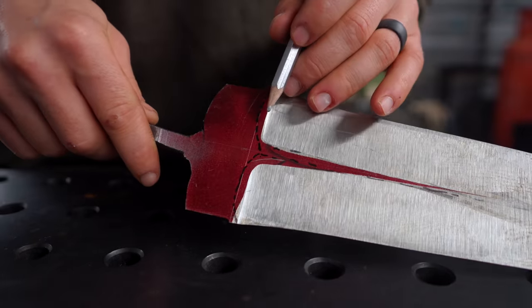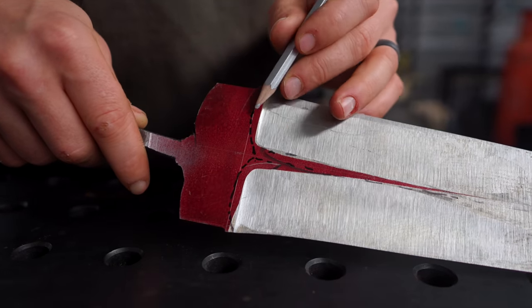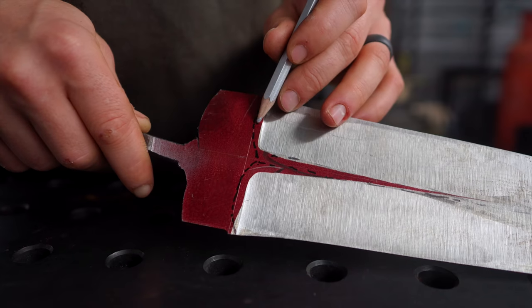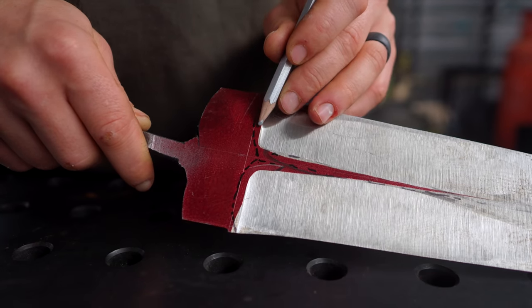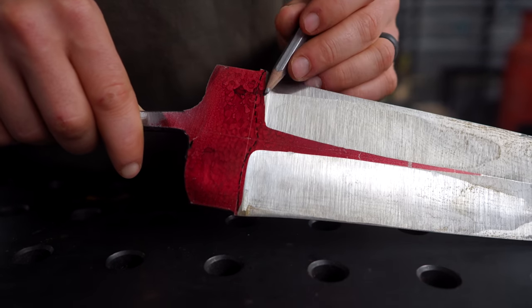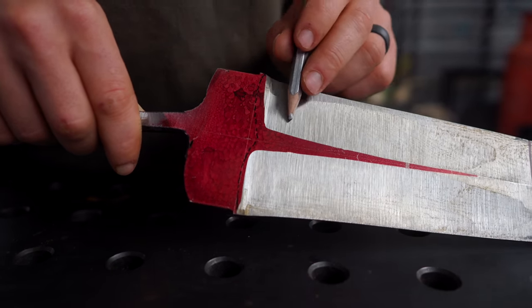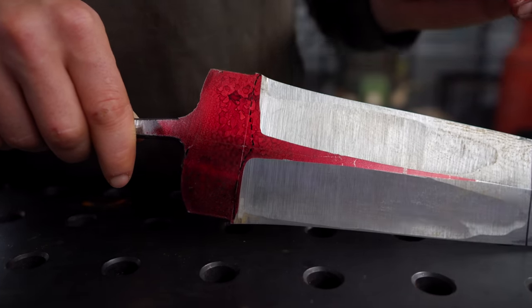One of the other things that I have to tackle relatively soon while I'm still in the roughing in stages is bringing my plunge lines back just a little bit further. I want them to meet almost in line with this scribe line we've got, but the trouble is pulling back those plunge lines makes me risk messing up some of the grinding work over here. So that's also something I've got to do before I go too far.